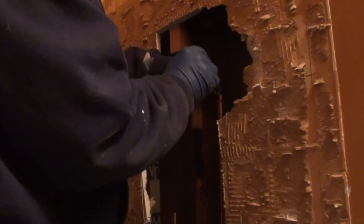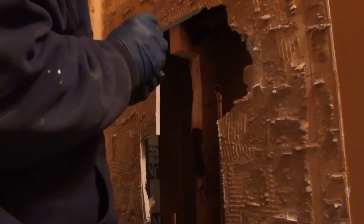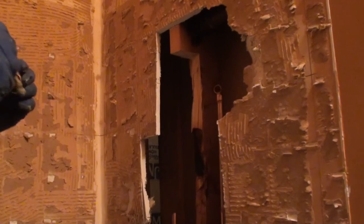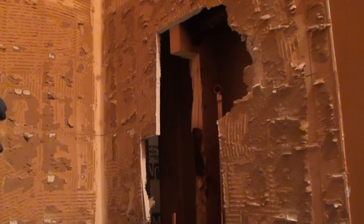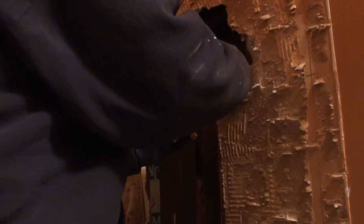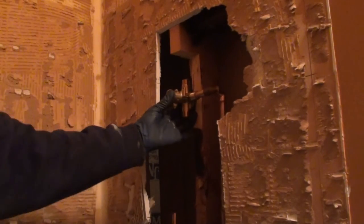Being that I took it apart and then put it together and then took it apart again, I'm going to re-hit it with the flux again. Don't go sparingly on it. It may save you a headache. Just slap it on there, be as sloppy as you want, because I'd rather it look all sloppy and you have a good joint than look all pretty and then end up being a leaking fitting.